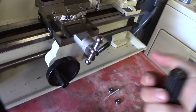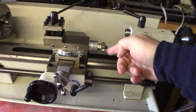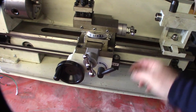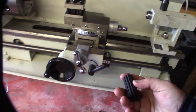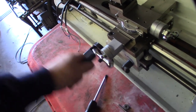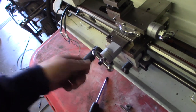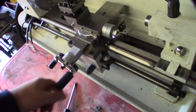I'll probably use blue Loctite on there. When I was designing this I didn't realize that the smaller one was actually shorter — same M5 thread size but the part itself is shorter, so I might design another one for that. Yeah, that's a huge improvement — the fact that it spins freely on its own makes it so much more comfortable to spin back and forth. Way better.